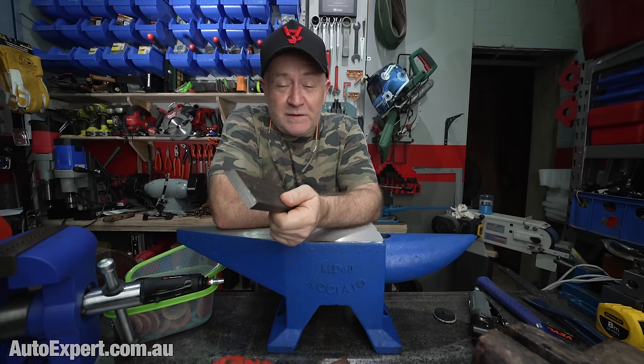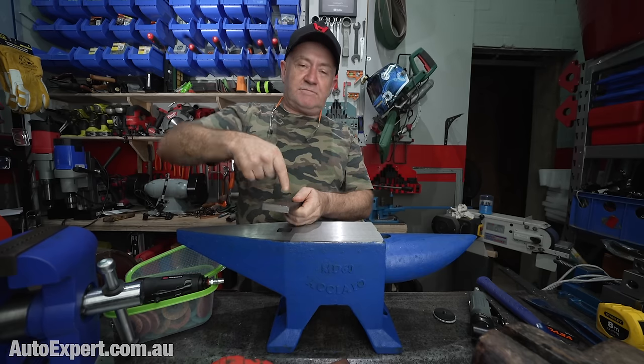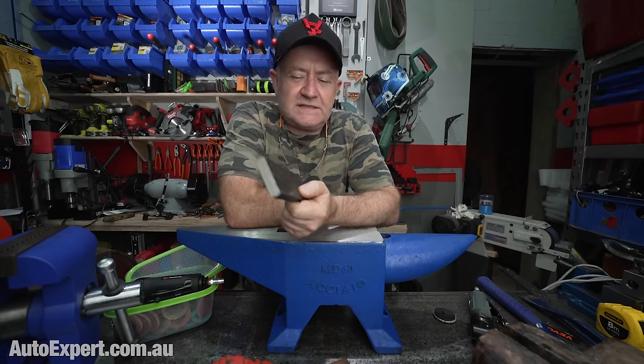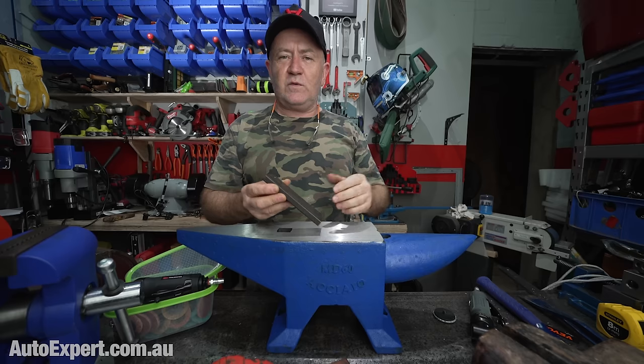Maybe it's better done in a press with a brake, you know, like a big fat piece of V-grooved whatever, and a matching brake that just comes down on top of it. You could do that in a press easy. Maybe a 20-ton press would do that pretty easy. You just cut it in half, right? If you want to bend it at 90 degrees, just cut it in half and weld it.